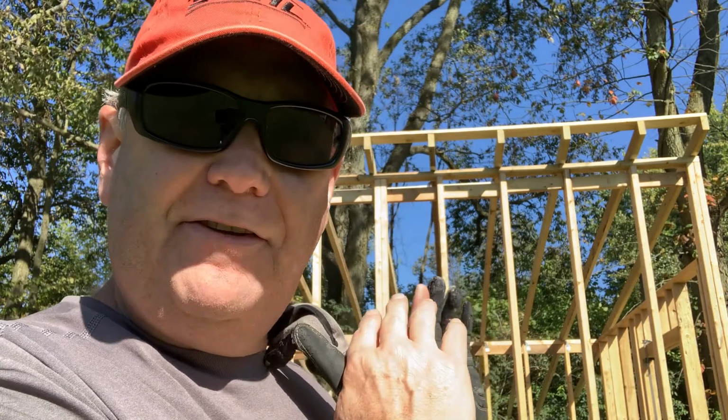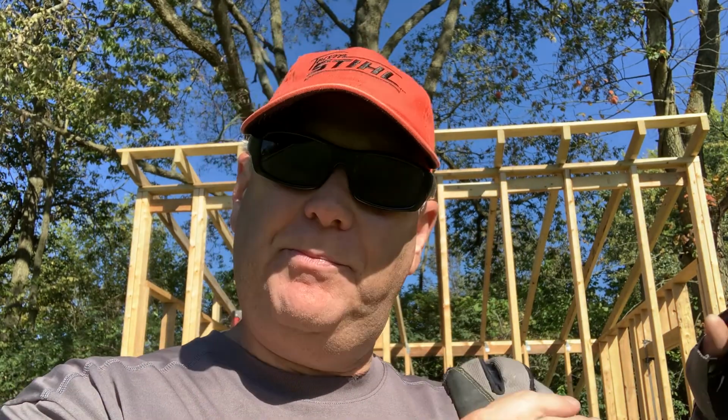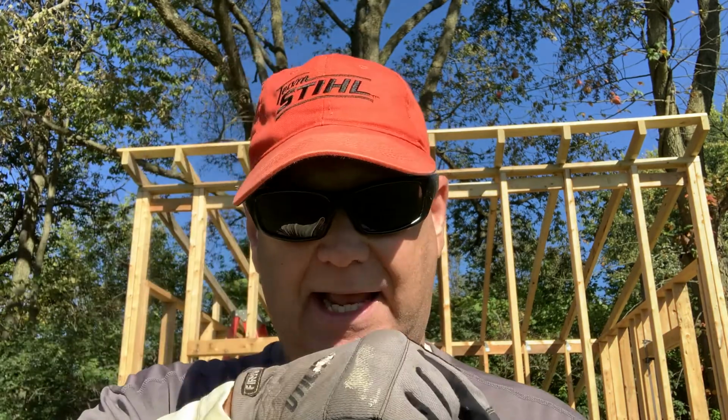So you get the idea. I'm not going to have you suffer through me putting every single purlin up at regular speed. What I'll do is set this on time lapse and finish the job, but you've got a good idea. That aspect of making sure that the space between each purlin is the same all the way across every joist, so when you put your metal roof up and you cut or drill all your holes ahead of time, they all line up in the exact same place.